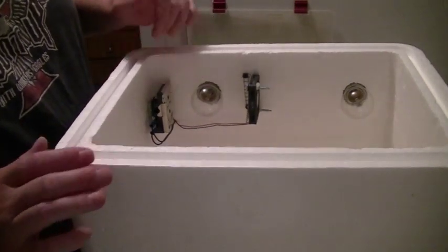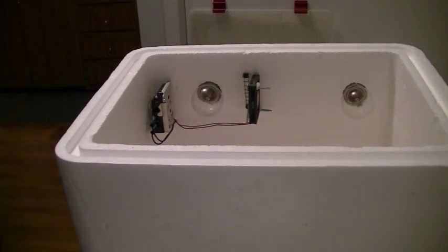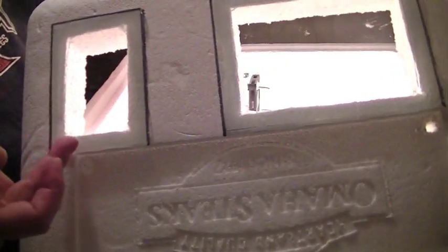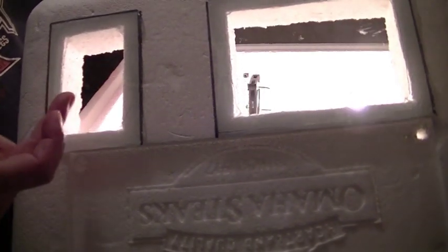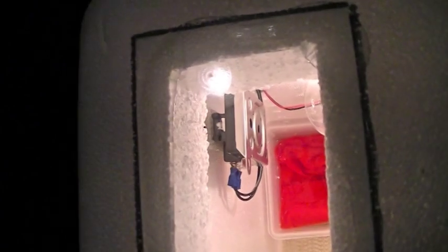All that's left to do now with this one is to do a power-up test, and we'll see if we got it working right. And there we have it. The only thing I did different on this one — see the top? We got a 5x7 glass right here for a good viewing glass, and I got a little 3x5 right here, a small viewing glass, because it will sit right over the top so you can see to adjust your thermostat if you have to make any adjustments on it. And you see how close that thing is to the bulb? You want to make sure that it is within an inch or an inch and a half to pull that thermostat into cycling like it should.